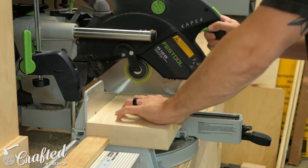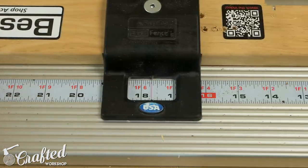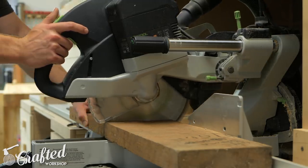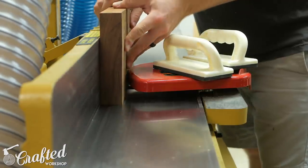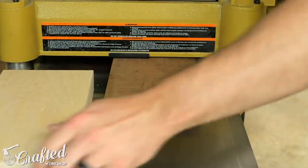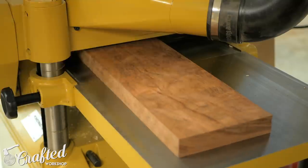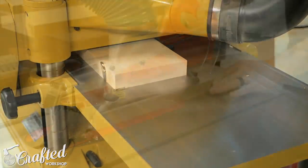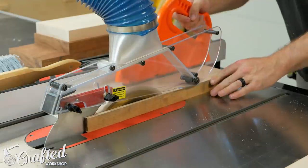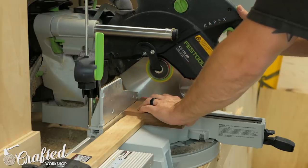The dimensions of the shelf pieces are 18 inches long by 6 inches wide for the top and bottom pieces, and 5.5 inches long by 6 inches wide for the side pieces. I left the two side pieces as one 11-inch piece since they would have been too short to pass through my planer otherwise. Next I flattened one face and one edge on the jointer to give me a reference surface. With one face flat, I put that face downwards on the planer and brought the opposing face parallel. This was my first time working with bubinga and it is just absolutely gorgeous. I also brought all the boards down to roughly an inch and an eighth thick at the planer, then squared up the other edge on the table saw, ripping the boards to their final width of 6 inches. Finally I cut the boards to their final length at the miter saw.